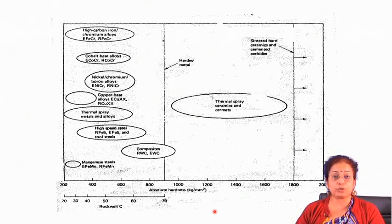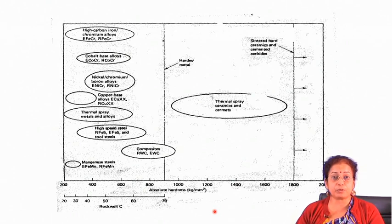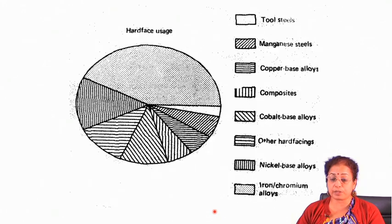When you choose the material for a specific application, you naturally have to choose the proper technique, which is equally important. If it is a metallic system you go for flame spraying deposition technique, if it is a metal matrix composite you go for plasma spray deposition, if it is ceramics or cermets you go for plasma spraying, and if it is nanostructured material or bulk metallic glass you go for kinetic spraying technique.